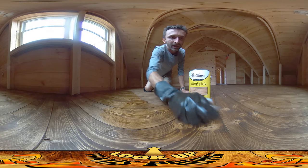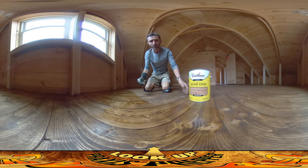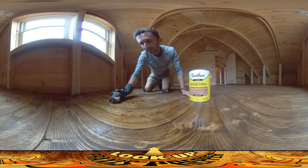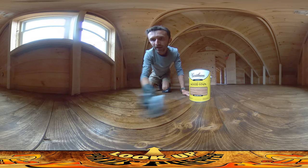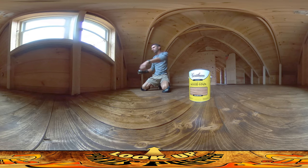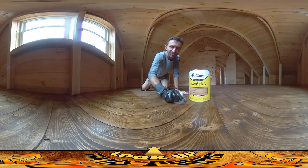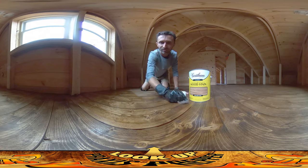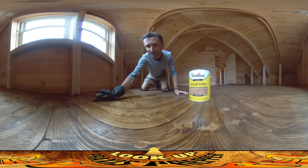It's a really subtle difference. It takes the areas of wood that were lighter dark brown and gives them this kind of orangey golden glow. This is the last pass before we seal the floor. I'm not bothering with stenciling at the edges — I'll just lightly feather up toward the edge. It's subtle enough that you won't notice, and it means I can move a lot faster. Stenciling the edges was what made it take eight hours last time.